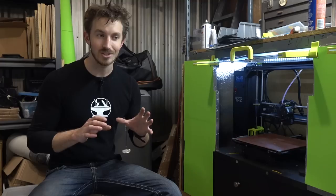We also looked into metal 3D printing. Unfortunately it's really expensive — from a service like Shapeways.com, the blade we showed off in the last video would have cost us $900 to print out of aluminum. And the other problem is the surface finish isn't quite that good, so we'd still have to polish it, which can be very difficult to do.